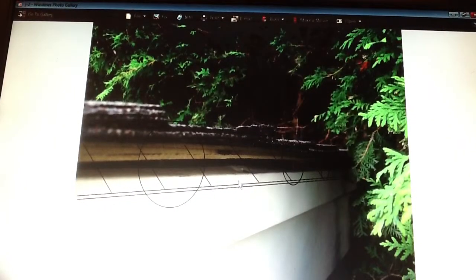Man, I did this roof, it had to have been 20 years ago. I took this picture and I've got miles and miles of use on this picture because it's a great photograph of what mold and mildew and dry rot does on a rake or a gable end. And it's typical to what you have on your house here. If you don't fix this, water's going to go in here, it's going to go in here, it's just going to give you all kinds of grief. And it won't take but a couple of winters to do it.